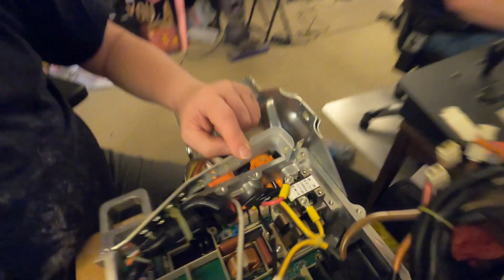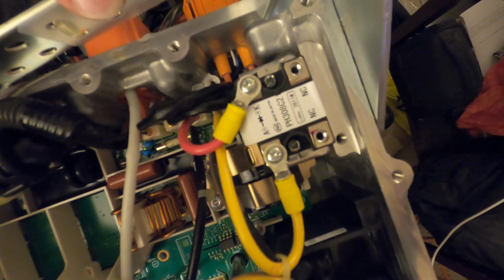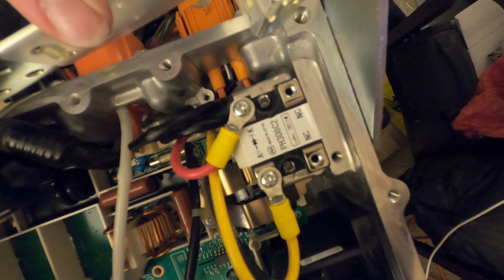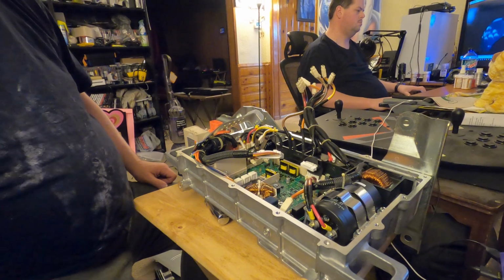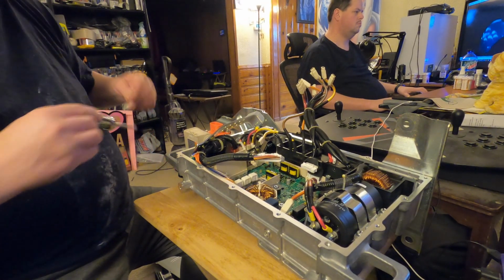So my thwarting here is these two heads on this diode. The two screws hold that diode to that little piece of metal. When I put the screwdriver to it, they didn't even offer any resistance. The slots just basically disintegrated on them. So that's going to end that. What I'm going to try to do is just connect one of these wires and redo the diode check just to make sure what I saw is true. But I'm thinking for this particular charger, that was the failed component.